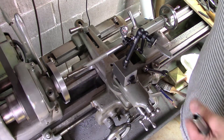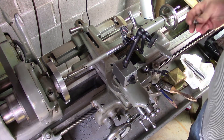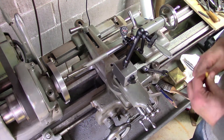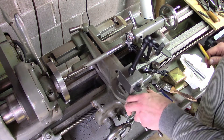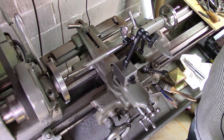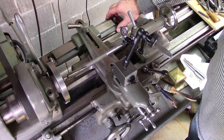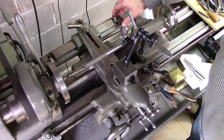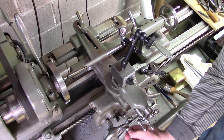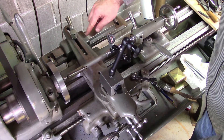To cut this Morse II taper I'm going to use a taper attachment — my lathe came with one so it's a good opportunity to use it. The way these taper attachments work: first you remove the screw that holds the nut for the cross slide, which allows the cross slide to float freely. Then on the taper attachment itself there's a bar that runs parallel with the lathe bed, mounted on a couple of bolts. If you loosen these, you can pivot the bar to match the degree of taper you want to cut. I've set this up to the Morse II taper angle, tightened it down, and as you move the carriage the taper attachment drags the cross slide along with it, following the angle of taper.